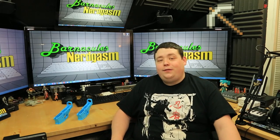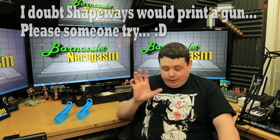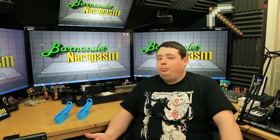And if you want to pay Shapeways, you know, $1,000 to go print an AR-15 that'll fire six shots, sorry, AR-15 lower, not the whole gun, I'm trying to reiterate that you can't do a whole gun. And then the other pistol, which I'll probably print at some point too, is the Liberator. Now granted, the Liberator, since all the pieces are printed on the same printer, even though there's a little bit of shrinkage in there, the parts are still gonna fit together perfectly. They should anyway. But you still need a metal firing pin in the gun for it to shoot. And it only shoots .22 caliber and the barrel wears out really, really quick. So even though that's closer to 3D printing a real gun, it's not really practical.